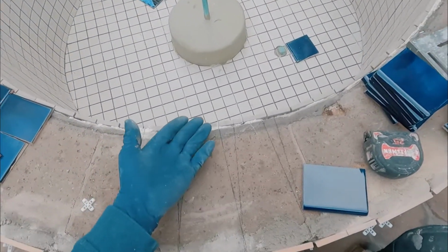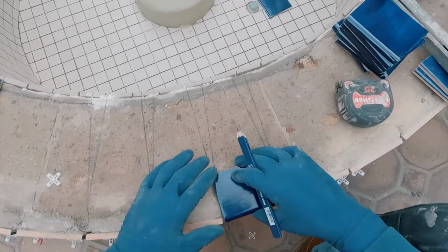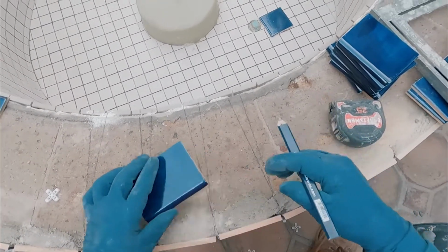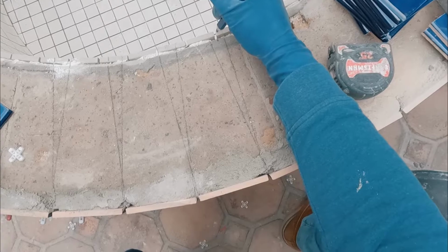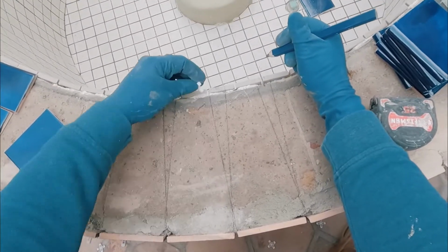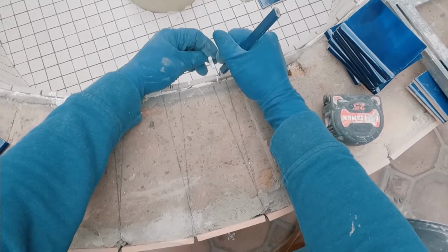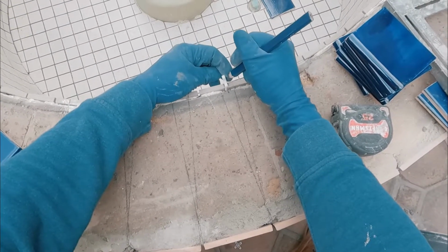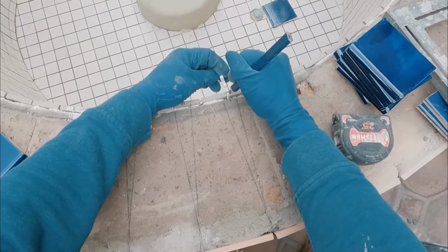Plus, there's no point of drawing it where you're gonna stick the tile, because we wanna mark the tile. So let me do it on this side, okay? Center is going to be right about there. We're gonna go 1/8 over, I'll put it there. 1/8 over should be right about there. Looks good. A little big, I'll stay on the inside there. Kind of big, I guess.